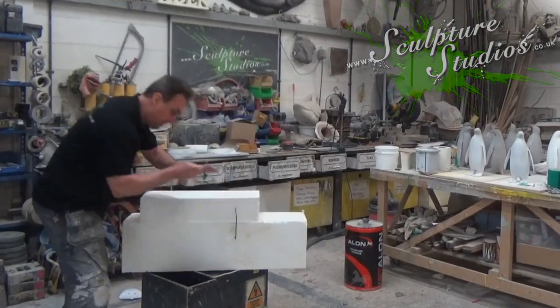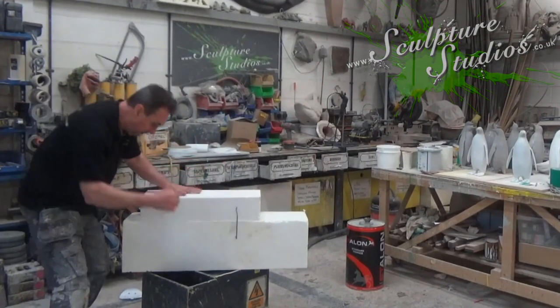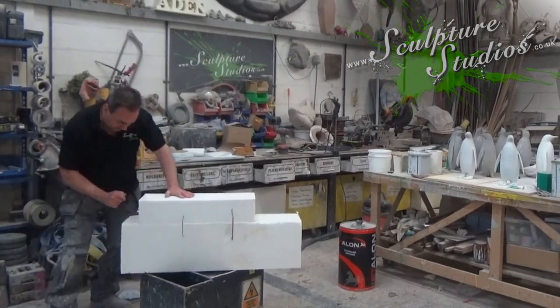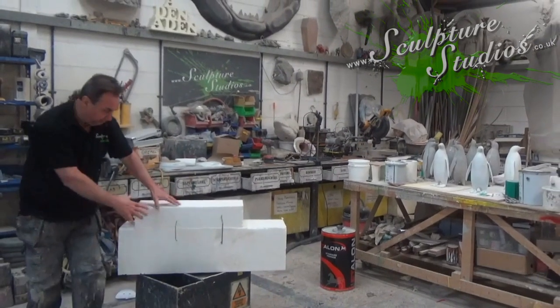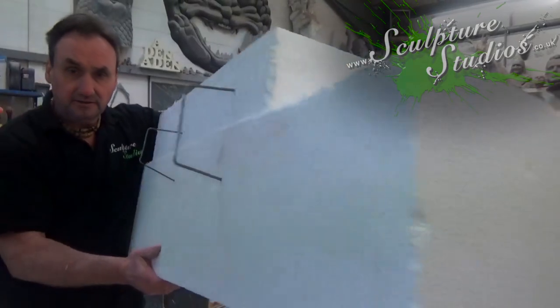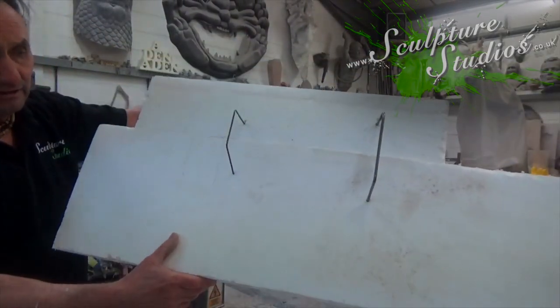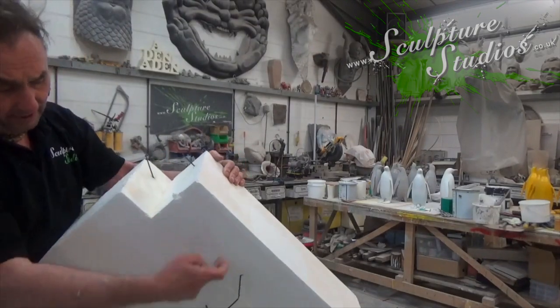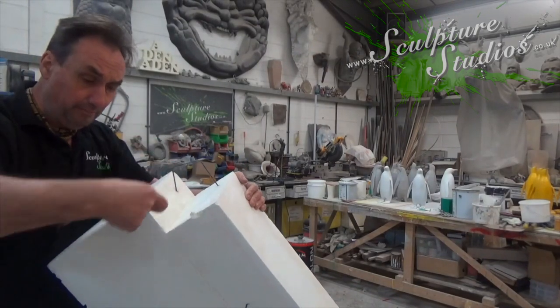I've squirted my foam inside there already, positioned it. Pushing my dogs in, making sure the legs are open just slightly. And I'll try and hit that as many sides as I can. Holds it together. So there's my polystyrene held nice and tight. And even if I do have a bit of a hole or a gap, I can use my PU foam and pump it up.